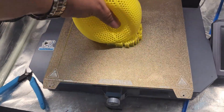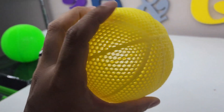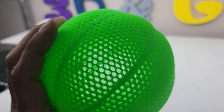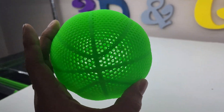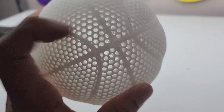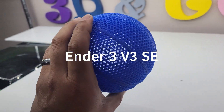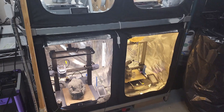Taking off the CR10 — let's look at the balls. Nice, no issues with the CR10 on TPU. All those retractions still did a great job. The KE — all the holes are looking good, not much stringing except from the bottom where it was supported — another good print. I'm gonna give it to the V3, it's way cleaner. The SE, the underdog — a little bit of stringing but still handled the retractions well.